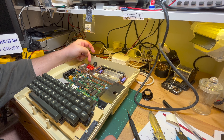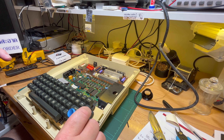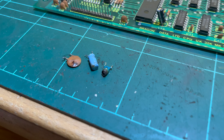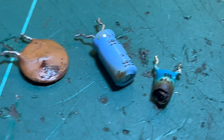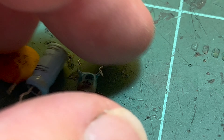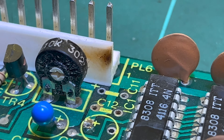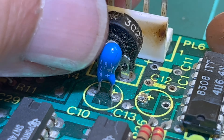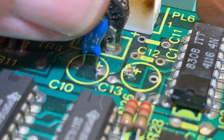There's an extra capacitor on there. Let me disconnect everything and have a look. I've removed the offending tantalum - 4.7 microfarads - and also the electrolytic and ceramic that were next to it. I'll replace all three of them: a 100 nanofarad, a 10 microfarad, and the 4.7 microfarad tantalum. No doubt someone will say in the comments that Dragons are known for tantalums blowing up - you should always replace them.